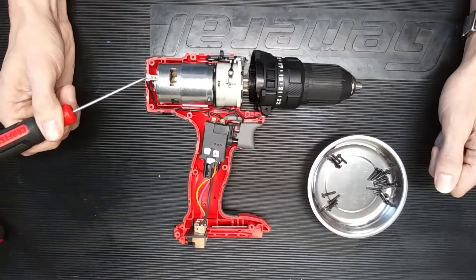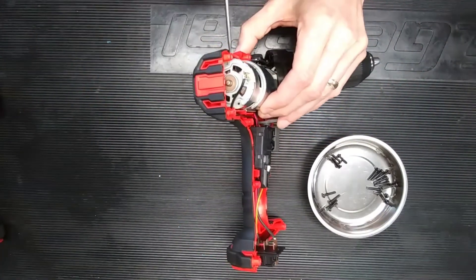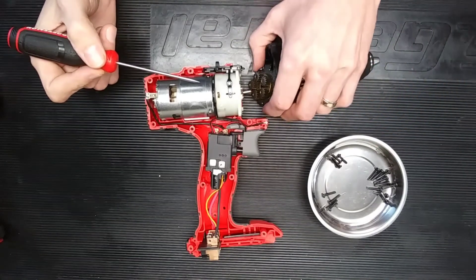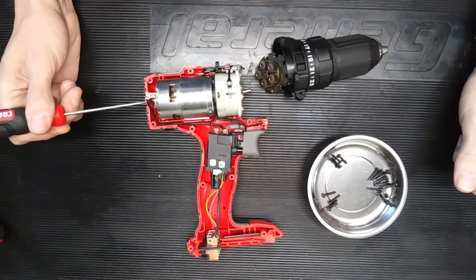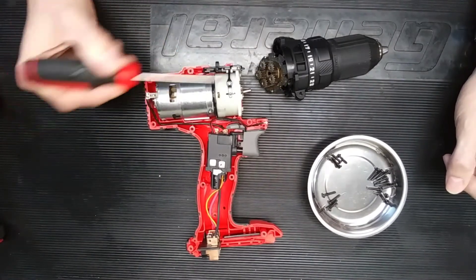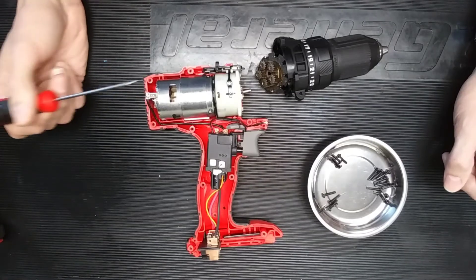Pretty standard terminal blocks — just push-on terminal blocks here in the back under the motor. Something important to mention: this has what looks like a bronze bushing in the back instead of a ball bearing. I didn't disassemble the front, but I assume it's the same on the front as well. Which isn't great, but given the cost of the tool, the bushing will work out fine. There's really no radial load on this because of the gearbox and the way everything's set up — it's really just rotational. So it shouldn't be a huge issue, and given the price point, not bad.